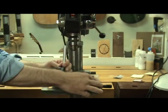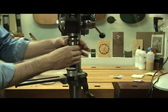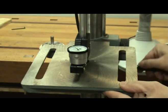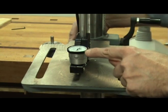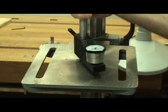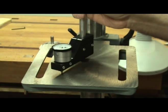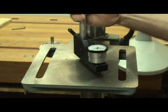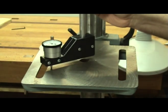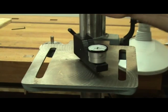All you need to do is chuck the DPPT up in your drill press — it just needs to be finger tight. With the perpendicularity tester in place, raise your table until it just starts to register on the dial, then lock it in place. You can then manually turn the chuck to check if your table is perpendicular. I'm coming in at about four thousandths difference, which is close enough — the tool works fine up to ten thousandths out.